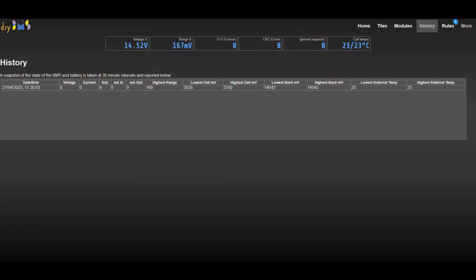I've also made a few updates to the controller firmware since that video. The changes fix a few bugs within the Pylon Tech and Victron CANbus control, and it also introduces a new feature to show a built-in data logging page. This takes a snapshot of the state of the system every 30 minutes and keeps a rolling 24-hour history. I find this is quite useful to quickly see how much charge has gone into and out of the battery overnight, or how cold the battery got when the weather was poor, without having to resort to other systems like MQTT or InfluxDB logging.